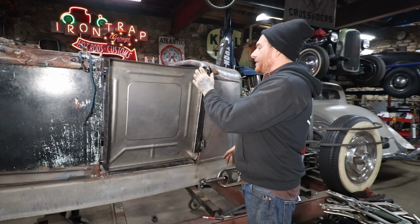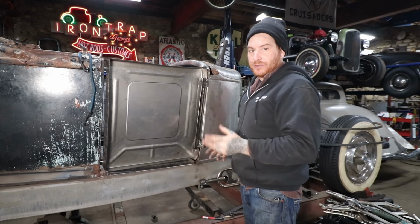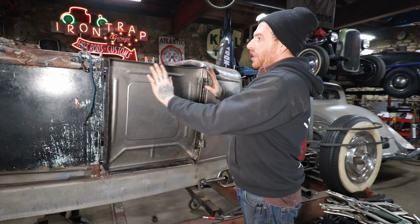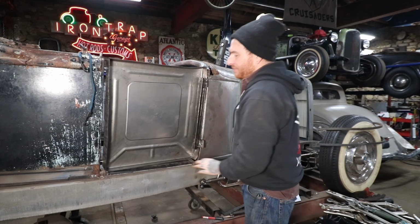It's also nice and sturdy, so we use that on the A and B pillars for where our latch and our hinges go, over using wood. I ended up running zip screws into each corner. I took measurements with a depth gauge of how the inner structure was sitting, and we got that all measured out, and everything's sitting with the inner structure just like the other side. I'm using a metal roller that I set the gap underneath, and all that stuff's looking pretty good.